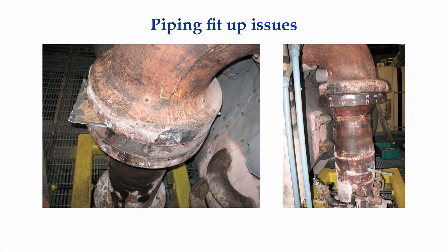I'm not sure what people want me to say about this. If our piping is misaligned by two or three inches, you are going to have to cut and refit the pipe. If the piping is somewhat close to being aligned but off by less than a quarter of an inch, there are ways we can possibly account for this when aligning the machinery. Dealing with small amounts of piping fit-up problems will be addressed in the intermediate alignment tutorials.